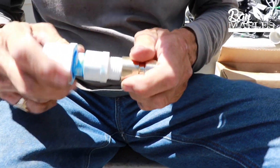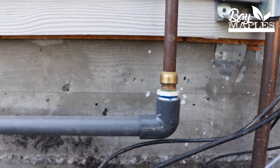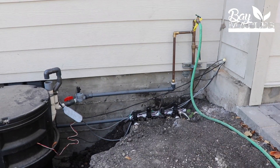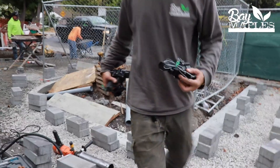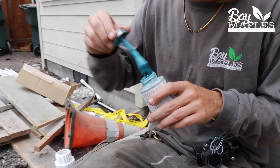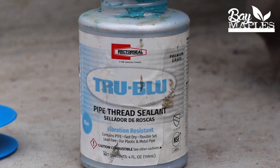This is a little transition piece so I can get back to PVC — it's got little plastic teeth inside. This is going to be one of the valves going to the front yard, controlling some of the water going from the gray water system into the landscape. This valve will probably control one section of the yard — for example, maybe the parking strip or the right side. We're going to be doing three valves in the front yard and four in the backyard. This is more of a sealant versus cement, just ensuring we're going to have zero leaks at the point of contact between the PVC and the valve.